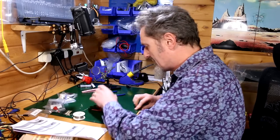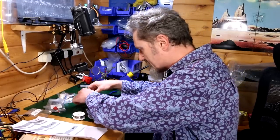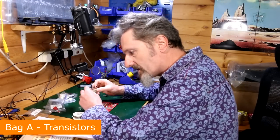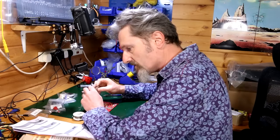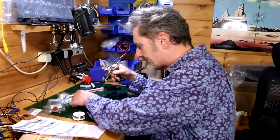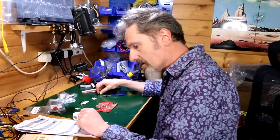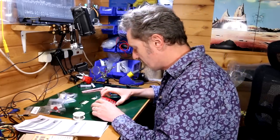Oh, good. So capacitors done. Right. What's next? This bunch of transistors then. Now, make sure they are orientated correctly. The curved and flat sides of the silkscreen outline of the transistor on the PCB must match the transistor's body. Cool, yeah. So there are four of these ones. 3904s, yeah. So I've got 1, 1, 2, 3, 4, 1, 2, 1, 2, and 1. Great, transistor time then. Let's get those in.